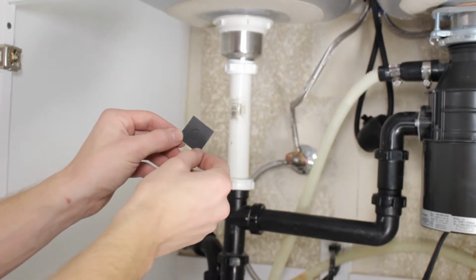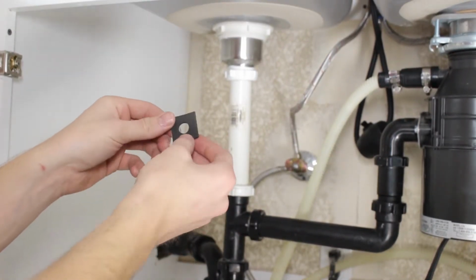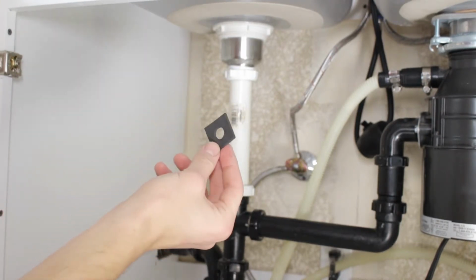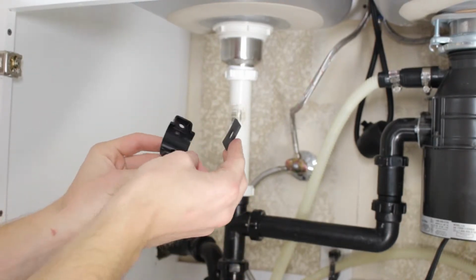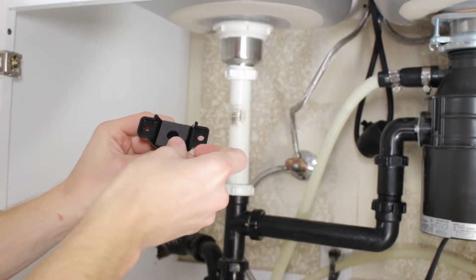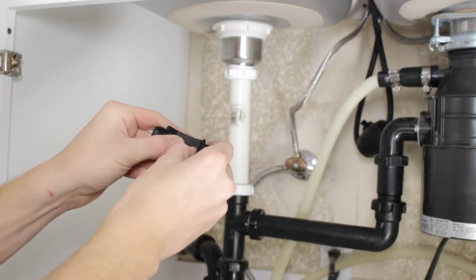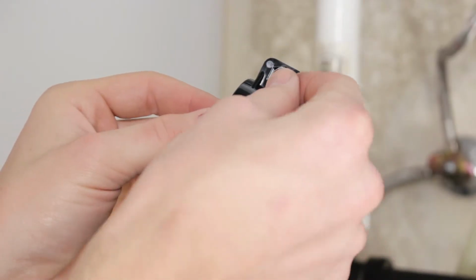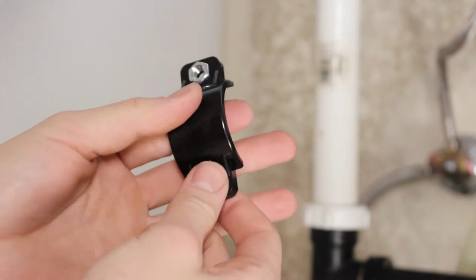Locate the foam pad included with your drain saddle and peel out the center. Peel off the adhesive tape on the backside of the square foam piece and locate the half of your drain saddle with the quick fittings attached to it. Apply the foam square to the inside, making sure that the holes are aligned. On the second half of your drain saddle, press the 2 nuts provided into the cutout sections until they are secure.